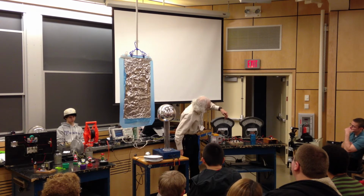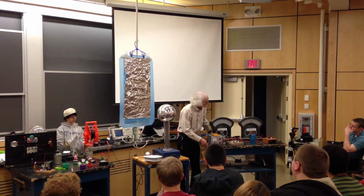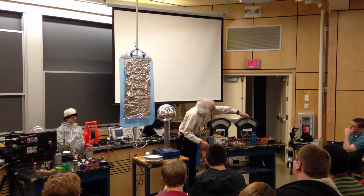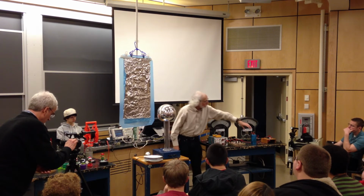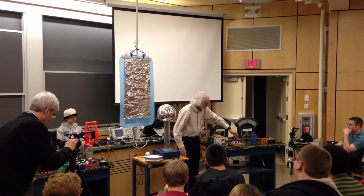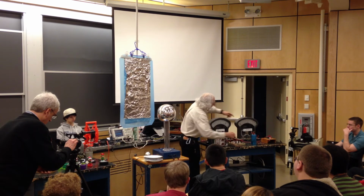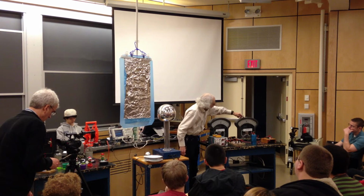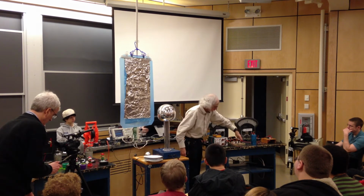Lots of current. As the voltage goes up, which is the repulsion effect, the current goes down. But notice that it trails off. It doesn't just zoom up to 0. It moves pretty quickly and then trails off until we finally level off at about 4 volts. So now I've charged this capacitor to 4 volts, and now it will hold that voltage. I'm going to discharge. I'm going to give it an escape route, and we're going to watch what happens. The current goes the other way, and the voltage trails off until with no voltage, there's no push on the charged particles, and they stop moving. Now we can look at that and we can describe it.